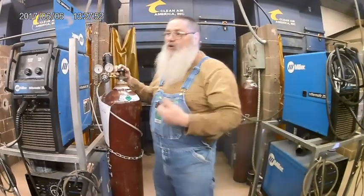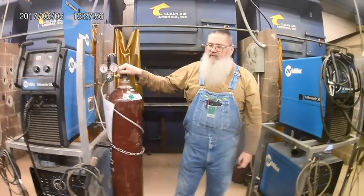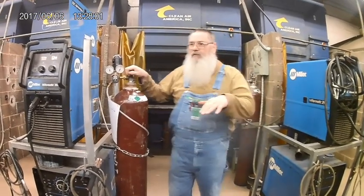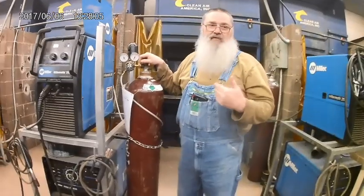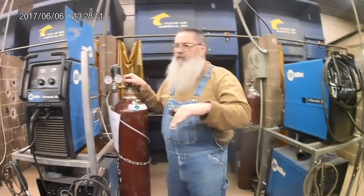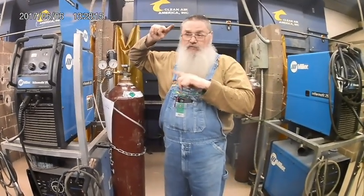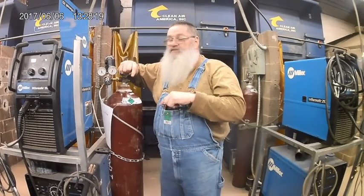So you left that on. You go downstairs to weld later, the next day or the day after, and Fluffy comes with you, the little chihuahua. Fluffy's going to hit that argon. Argon does not support oxygen. It doesn't support human life. It's heavier than air. It's kind of like water. So it's almost like Fluffy just walked down in the basement and got in water that deep. Only thing is Fluffy's not going to notice it quite as quick. And after Fluffy takes a couple breaths, Fluffy's going to drop over dead. Same thing can happen to you.